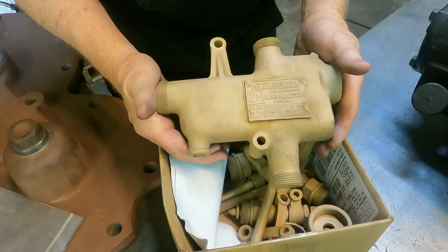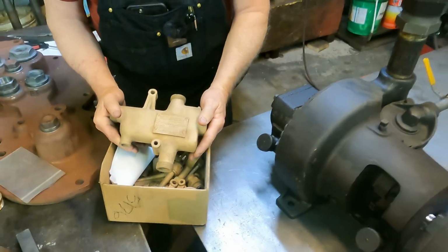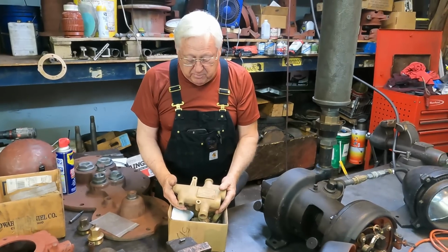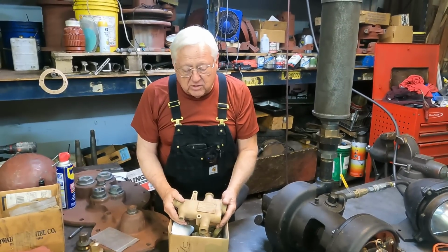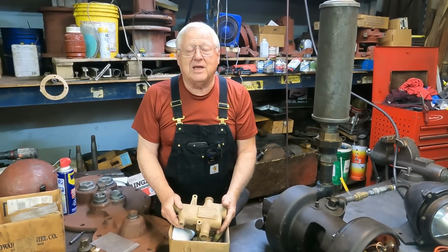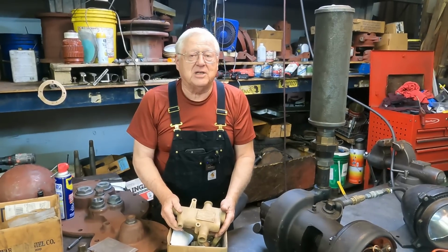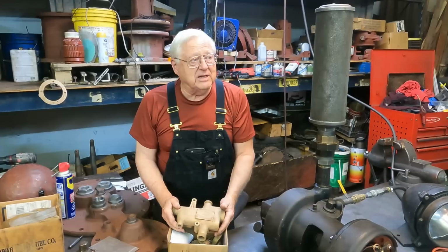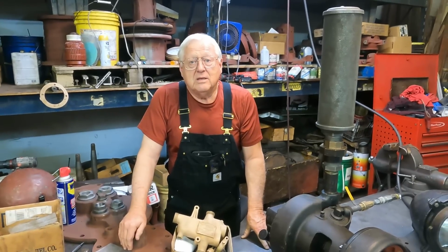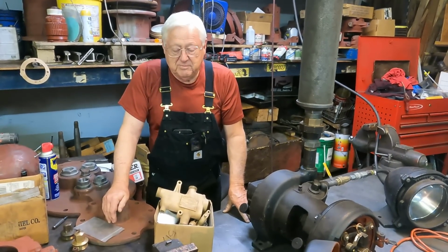The injector puts the water into the boiler. And there's a certain amount of voodoo in this. That's a good way of putting it. Well, you think about it, let's say you have a 200-pound boiler, and you're going to take that steam and put it through an injector, and it will pick up the water and force the water into the boiler. And you think it's a pressure situation, but no, it's got to do with taking the power of and expansion of the steam and transferring that to the water, and then that pressure that's generated lifts the check valve on the boiler check of the engine. So if you think about how do you put fresh water in a boiler that's pressurized, you got to have more pressure than what's in the boiler, but yet we're going to use the pressure in the boiler to do it. So through that injector, it basically does a little voodoo and creates a higher pressure level to push that cold water into the boiler.